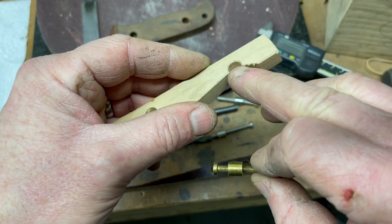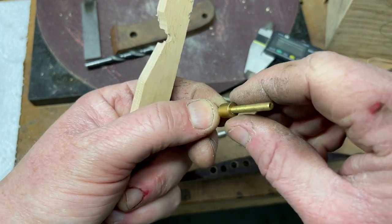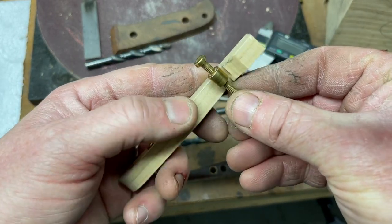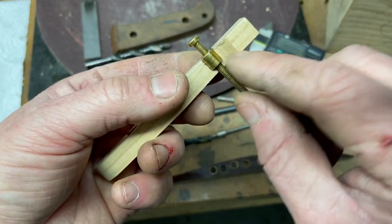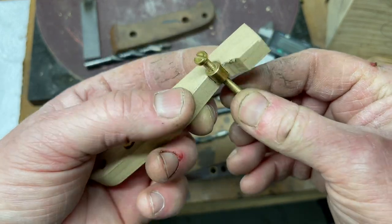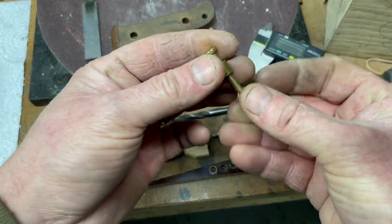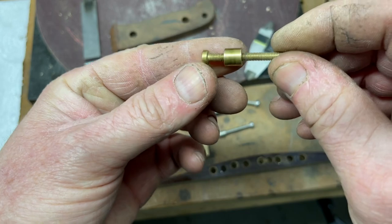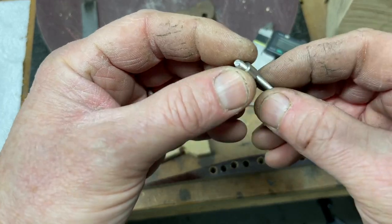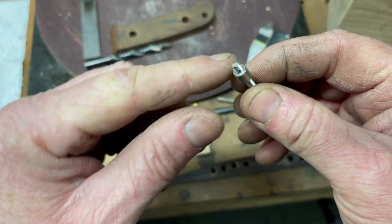We're trying to create this counter bore using the approximate size hole — for this sleeve nut that's about 8.5mm. They're actually imperial: 5/16 and 1/4 inch are the ones I use, but I use metric drill bits because it gives you a little bit of extra space. You need a bit of a gap for your epoxy, but if it's too tight you won't get the bolt in and there's a chance you might split the handle material. So I use two sizes: 8.5mm for the 5/16 nut, and 6.5mm for the quarter inch.